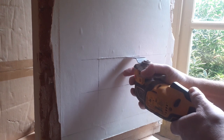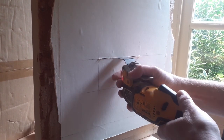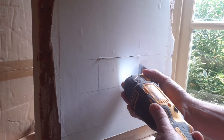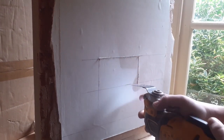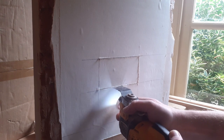Get rid of the plaster first and take your time — there's no rush. Put the lines as close as you possibly can, make sure they're nice and straight, and that will help keep the final socket nice and straight on the wall. This plaster just wants to fall off the wall, so be slow and gentle.